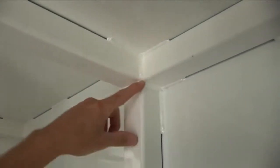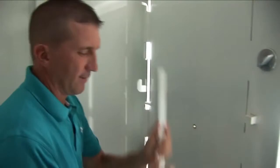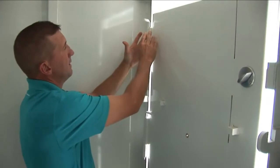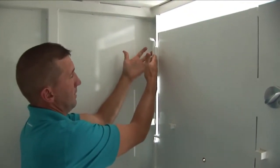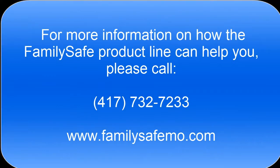Here is where you can see our steel cage — that's 2x2 square tubing, with corners supported by heavy angle iron. Perhaps the most unique thing about our doors is they can be removed. If there were any impingements on the outside, you see the hinges we have here — we simply raise them just a half inch or an inch, and the door will swing open past the locks, or the door can be removed entirely. The hinges being on the inside is a nice option because debris is thrown against the shelter. It's also supported by this heavy piece of 3/8ths angle iron that the hinges are actually welded to. And there's a peephole, so that you can watch the storm come.